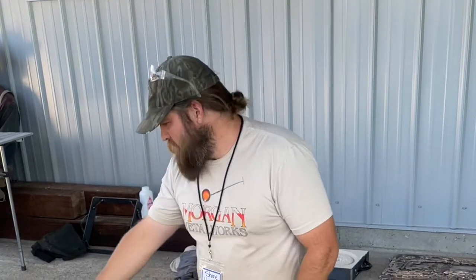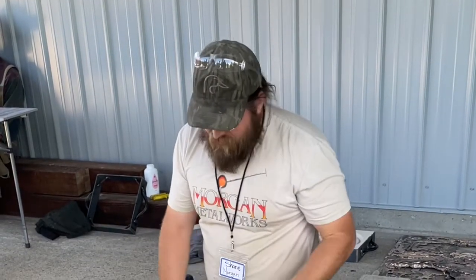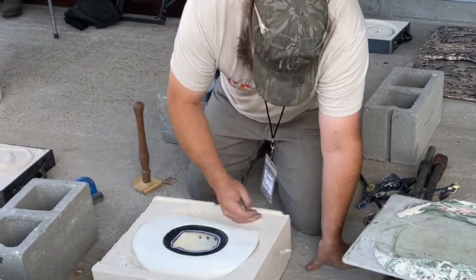With green sand you've got to work in metal flasks, or it's not going to work. The flask is built to hold the sand and you have to be real gentle flipping it over without messing it up. This is a lot more forgiving. This is silica sand — I use 70 mesh because it's finer particulates and gets better detail.